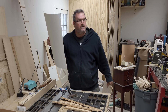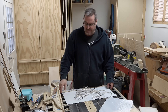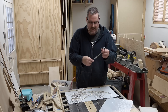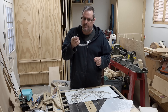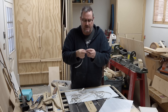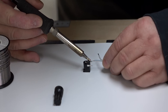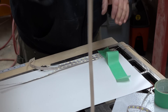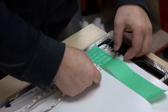I have a sheet of aluminum roof flashing here. It's actually bigger than I need, but I can lay everything out on it and then cut it down to size afterwards. I've straightened the piece of aluminum out as much as I can and I've got my snake's nest of LEDs laid out. I'm looking at the end with the plug, and I think the intermittent contact is just due to how cheap these connectors are, so I'm going to replace it with a plug on the outside of the frame. I've got tape on the LEDs just to make sure they don't move while I'm laying it out.